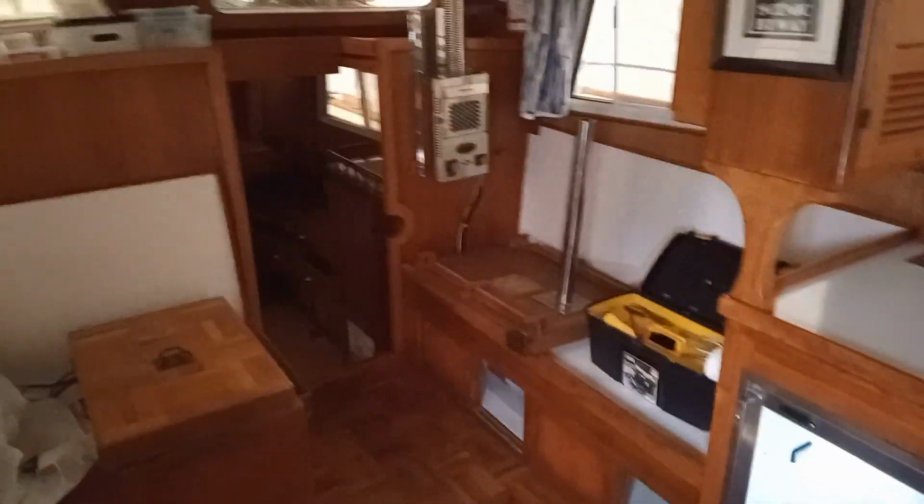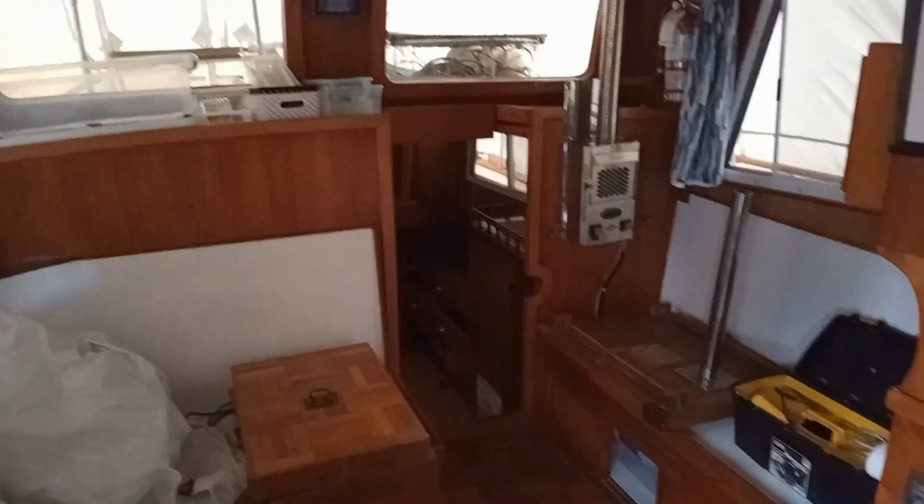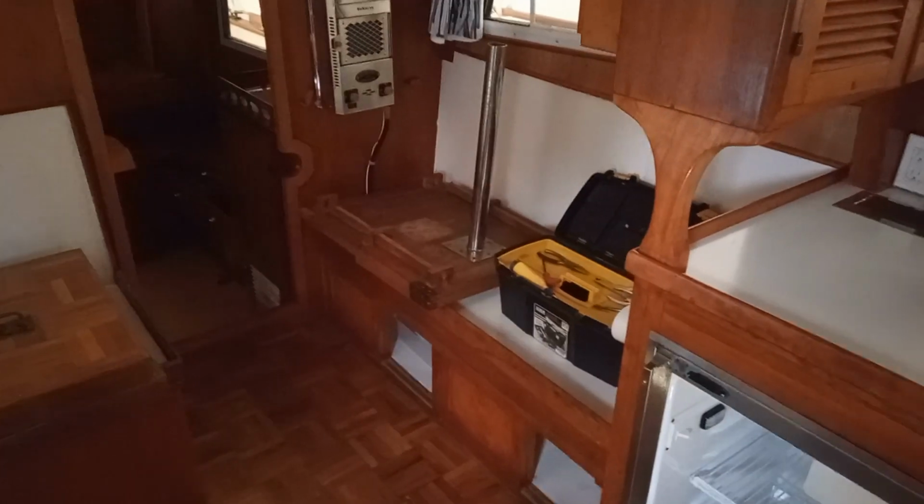And we're going to leave two of these little low wattage heaters that are just to keep moisture away. This one's called air dryer mildew fighter, so it puts out about 130 watts, and I have two of them, and I'll just leave my inverter running so the transfer switch is working for those two. And I'm also going to leave a light down here in the engine bay, so probably equal to about 260 watts total of heat that'll be going on in here, just enough to fight any moisture that might happen. We've taken out all of our stuff that's fabric. You can see all the cushions are gone and everything like that. Oh, missed one curtain. I'm going to grab that curtain.